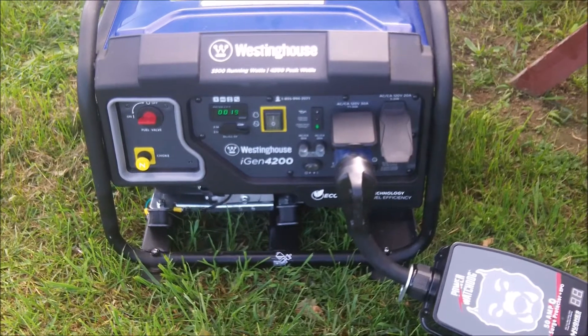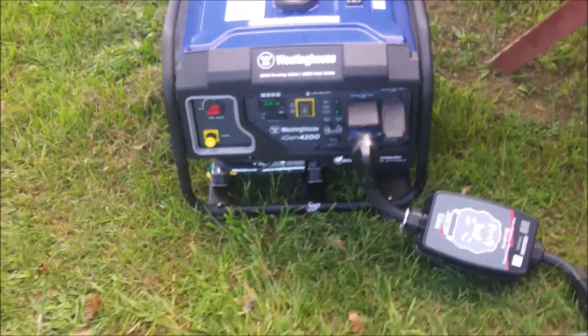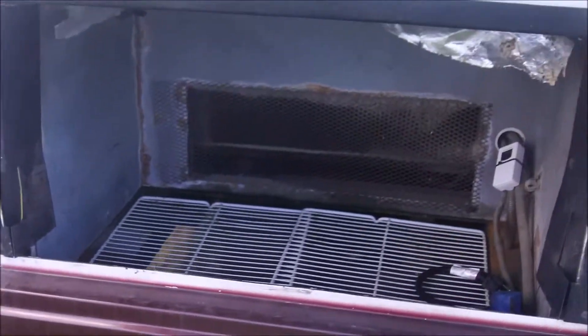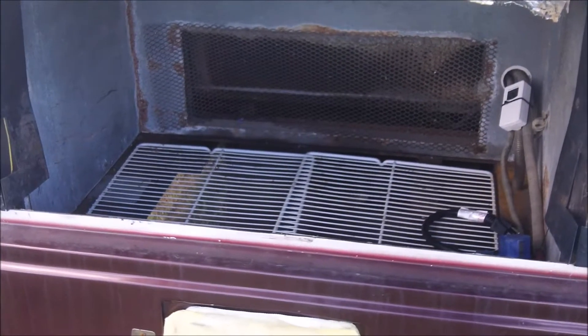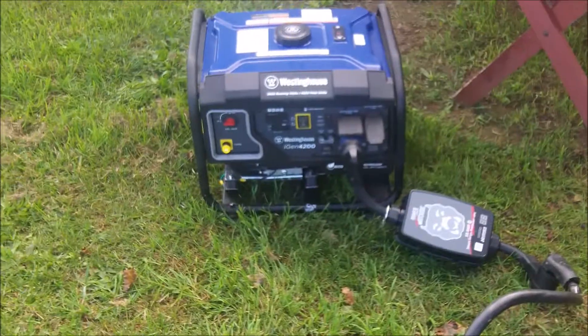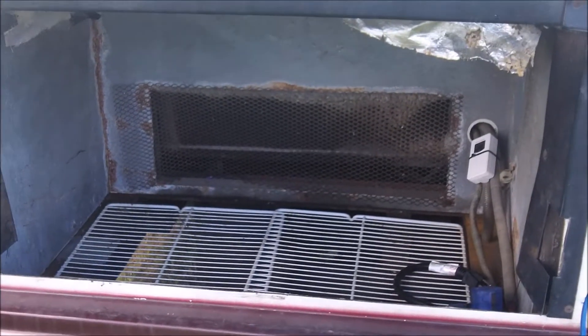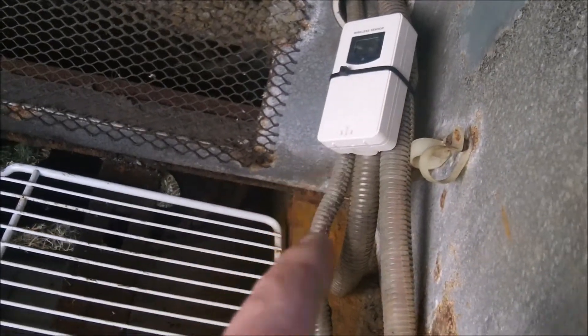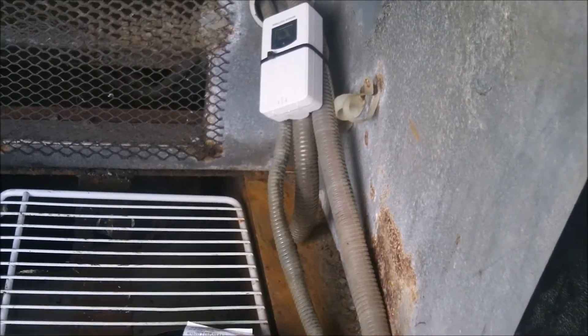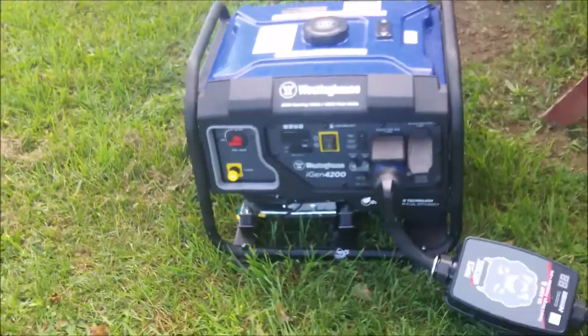This generator runs excellent. Welcome back to my channel, guys. I got a couple things I want to do to this generator. A while ago I took my Onan generator out because I didn't want to put the money in to fix it — it was 22 years old. I tried to run the generator in there without an exhaust and it just got too hot. I even put a thermostat back here to see how hot it got. So I gotta make an exhaust to go down and run out the back. That Westinghouse generator fits in there perfect.